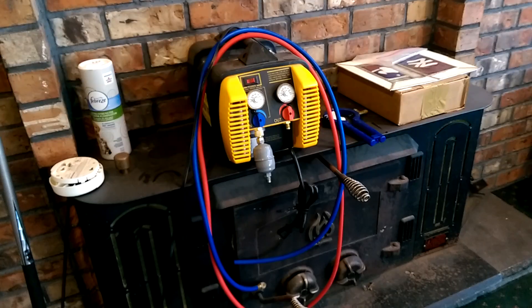If not the cheap Alibaba one, the bigger stainless steel one - or a Haskell pneumatic pump - is what I'll end up running when I run an active system. I need to do a straight unedited raw clip where I recover seven pounds of n-butane in 20 minutes to minus five. Give me five more minutes and I'll get it to minus 15 or minus 20.